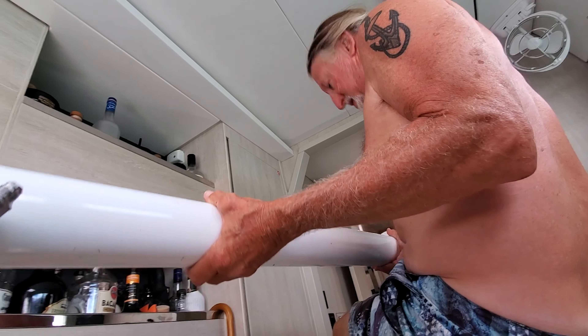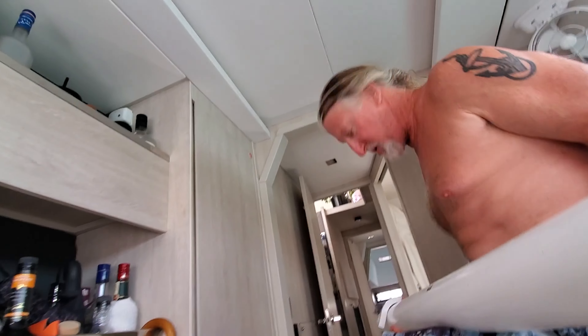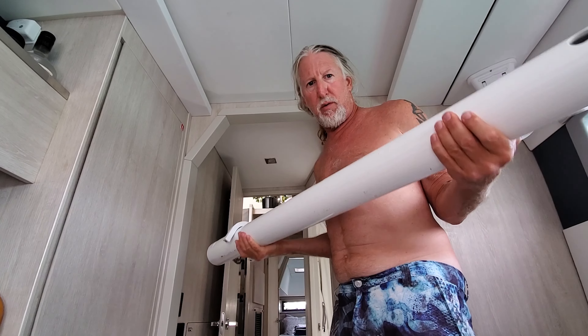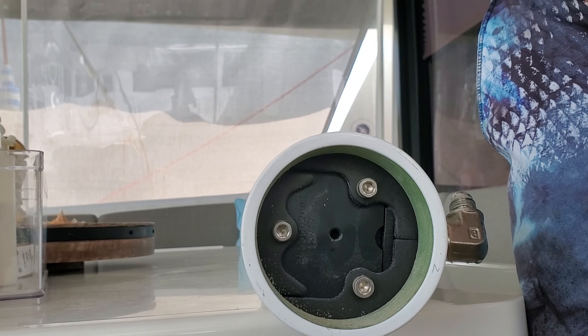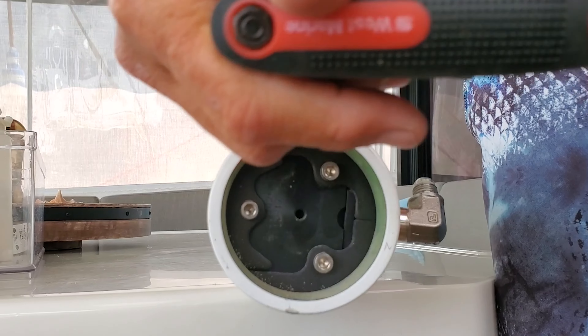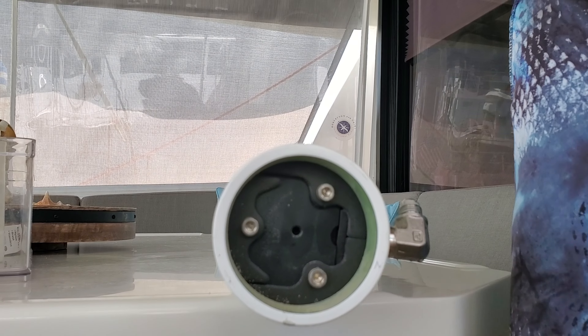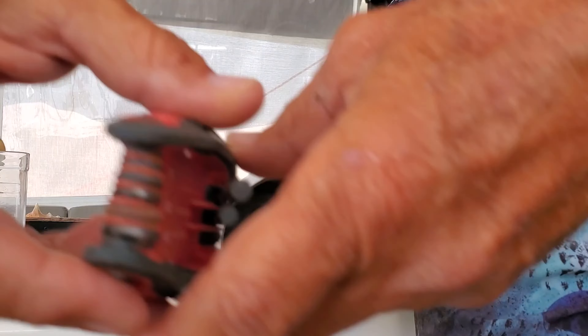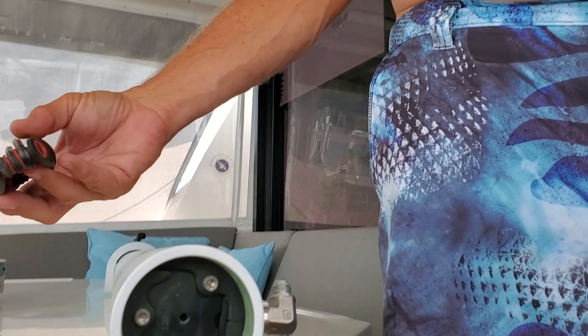We got the membrane tube out — it's heavy. The manual says we need a 5/16th allen wrench to take it off, but the 3/16th works just fine. We spent about an hour searching for a 5/16th. We've got a bunch of 3/16ths and no 5/16ths. The manual is wrong on that one.